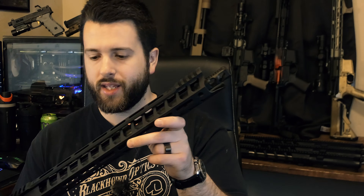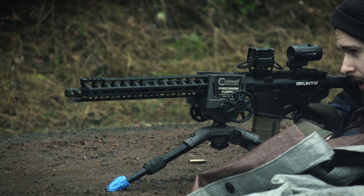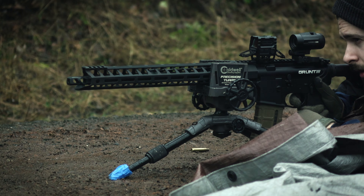It is a little bit long, of course, since it blocks off the muzzle device if you wanted to swap it out — but that's just part of this gun's design. The lockup is very good, so anything mounted all the way out there has a very good chance of holding zero. Getting into the muzzle brake itself: this is, as mentioned, a two-port brake. On a 5.56 gun with a muzzle device of this size, it is incredibly effective. It's made out of 4140 chrome moly-vanadium steel — very strong and tough. All of theirs come pre-drilled for a pinned-and-weld, so on a 14 or 14.5-inch barrel you could pin and weld to make a legal 16-inch. It is timed with a crush washer.